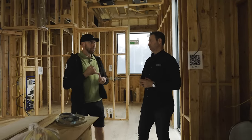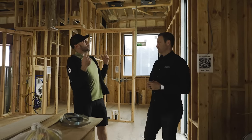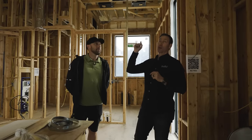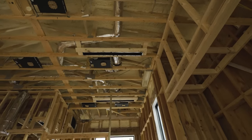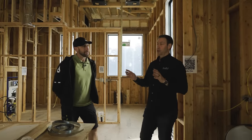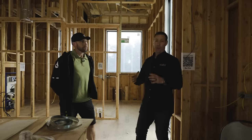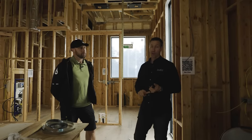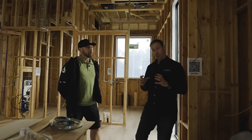Certainly planning for your power needs, because you're going to want to operate these electrically — and then any control wiring, all of that. But what you needed to worry about here was structure. That's right, it was trusses. These are, as you can see, an almost flat roof truss. So we worked with Builders First Source to make sure that these shade pockets would fit in the truss design. You said something really vital: you really need to know all the details about that shade ahead of time. You can't just say 'I want shade pockets.' As builders, we need to know the exact roller dimensions, the exact manufacturer dimensions, because the power might come on the right, left, or middle — who knows. And the size of roller makes a difference too.